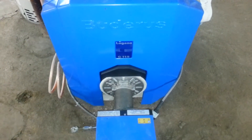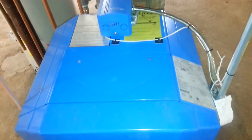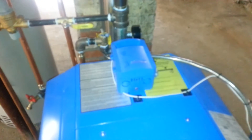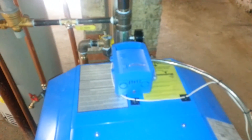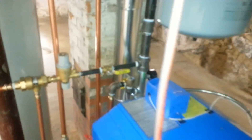What you're looking at is a Buderus G115WS3. It's the smallest 115 Buderus makes, and it's oil-fired with a Riello burner. Here is our hydro-level high limit and associated piping.